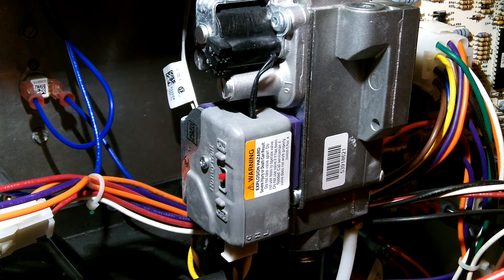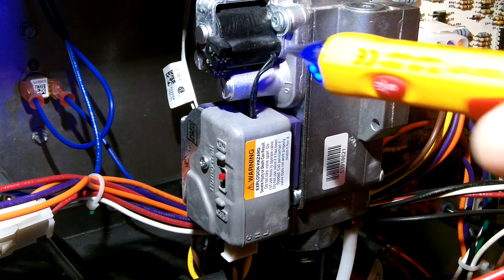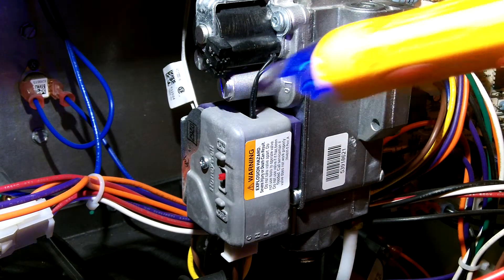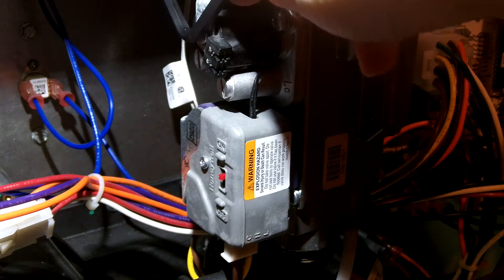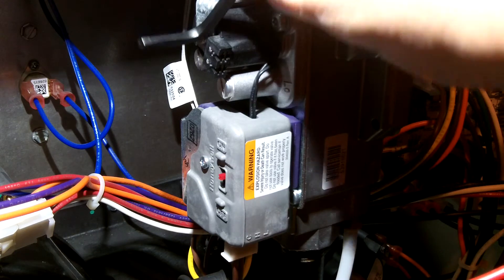High is now on. I do have the gas on right now, but as you can hear, the gas is not flowing — because that low solenoid is not open. That's the main gas valve, so if it's closed, opening the high isn't going to give you any gas. I can verify the high is active using my non-contact voltage meter — it goes off on those wires. If you hold a piece of metal next to it, you can feel it's slightly magnetic.